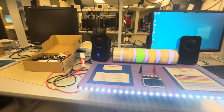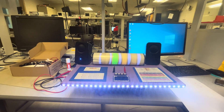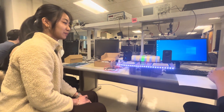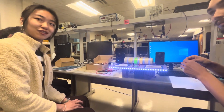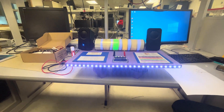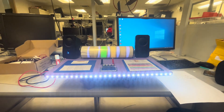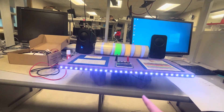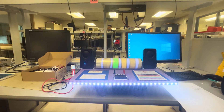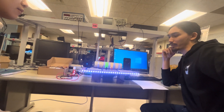Are you measuring the resistance by means of the ADC measuring the voltage across the resistor? We have a base resistor used as a voltage divider. We measure the point between that resistor and the unknown one — that node goes into the ADC. So there's a resistor with a known value underneath that forms the other resistor in a voltage divider, and we measure the voltage out via ADC and recalculate the resistor value using the voltage divider formula.